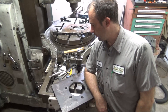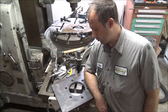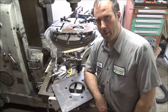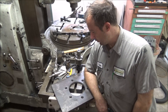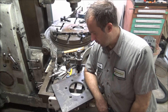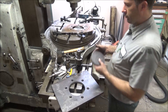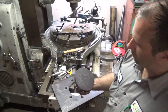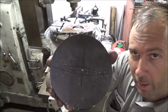I knew better than to listen to anybody that I work with that runs CNC machines to try and trepan that out — I kind of knew I was going to end up with a broken cutter. But I only broke one, so that's not too bad. And they're small ones, not some of my big end mills that are $100 a piece — those are probably $10. So this goes into the price of doing the job. Next time I'll be on the lookout for a trepanning piece for the lathe because I think that would be the best way to do something like this if you're going to try and save the piece out of the inside. I did save a nice slug from the inside, so I always got that. You can see the centering lines on there — the method I used to find the center of that plate.